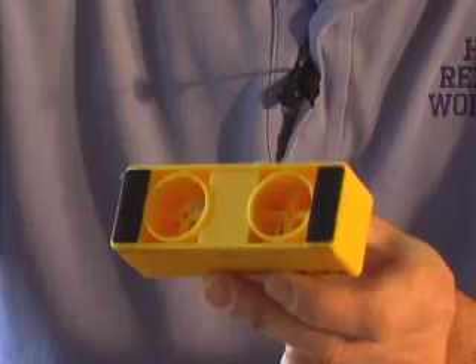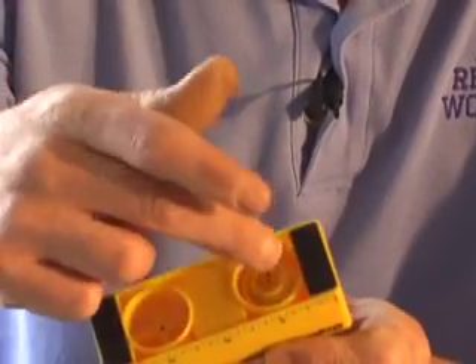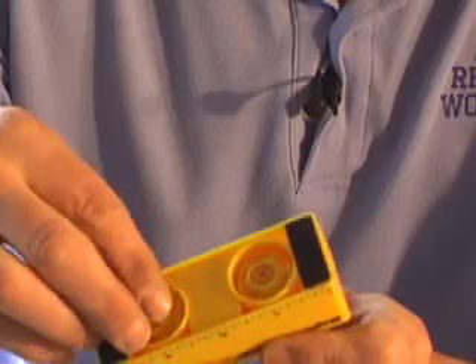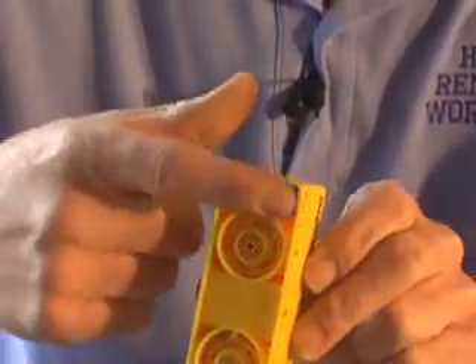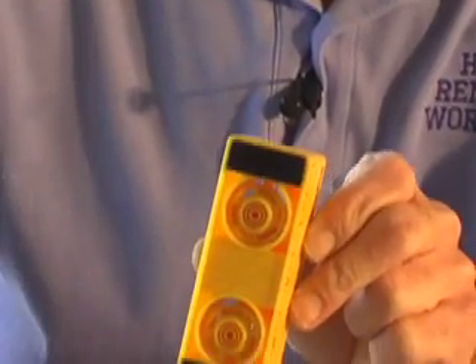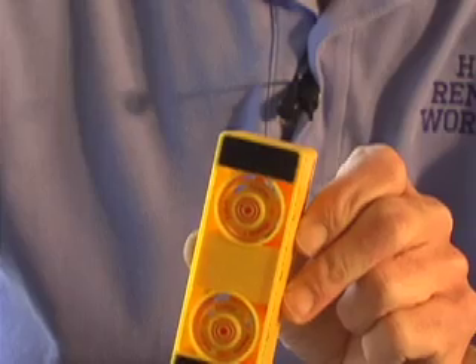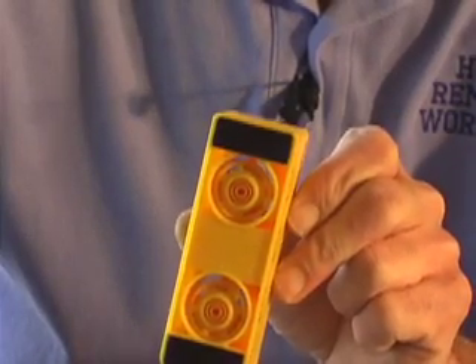With this little applicator that they send along with these targets, there's a little bitty piece of metal in there that just barely holds these in place so that you can turn it upside down without them falling out. You take these little felt pads and you rub this along the drywall wall, and as soon as it finds a nail or a screw, it jumps off and even makes a little clicking sound, letting you know right where that stud is.